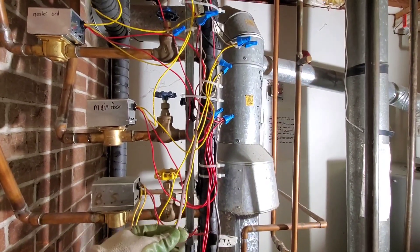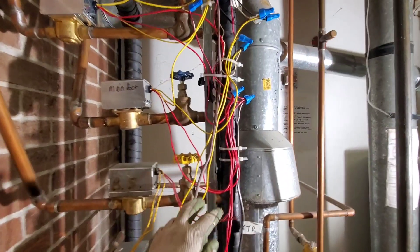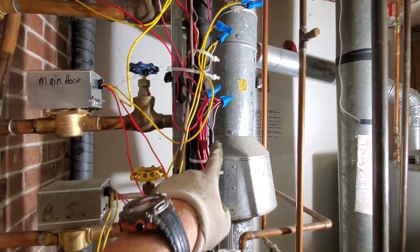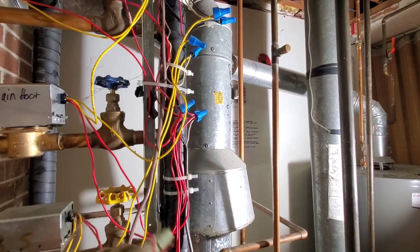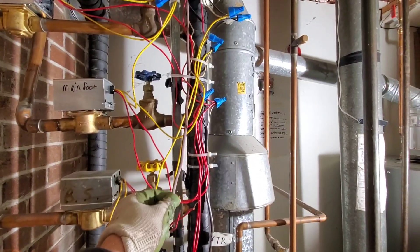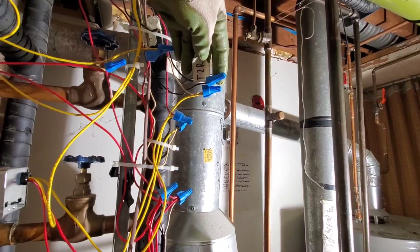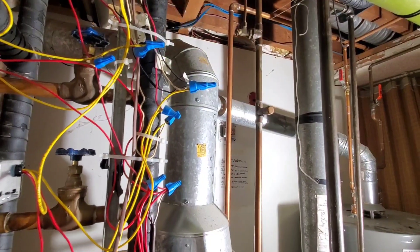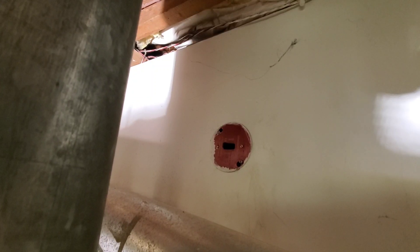This is our wire here. Because I cleaned this up last time, everything is a lot easier to see, and everything's been labeled — these are our end switches. For this zone, this is our external transformer: the white is the hot and the black is the common — they did this backwards. I'm going to connect the two end switches to the external transformer, then connect the thermostat wire to transformer 2 R. The heating system has been completely shut off. The first thing I'll do is wire the end switches going to the external transformer.